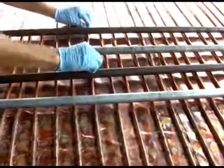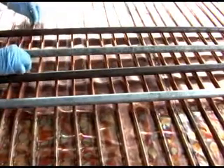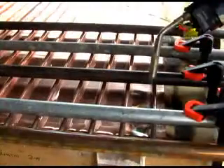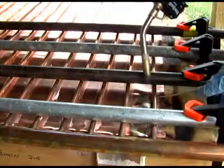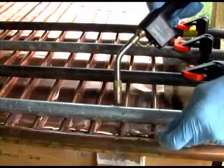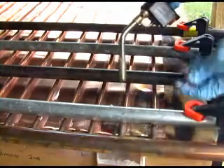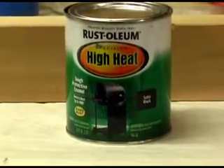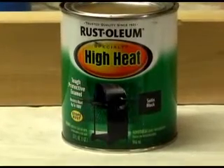At this point you can straighten the copper tubes that are wedged between the black iron pipes. You will spend about an hour soldering the copper sheet to the pipes. The soldering process causes the copper to ripple — this is fine. The other side of the sheet is the face of the panel. I sandblasted the face of the panel to roughen up the surface for painting.